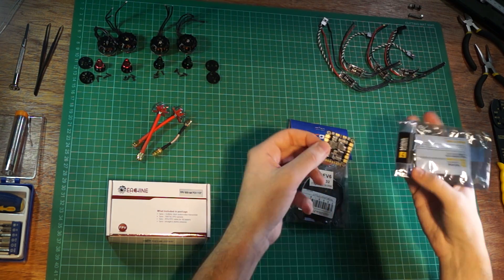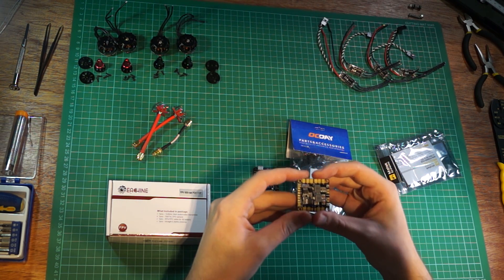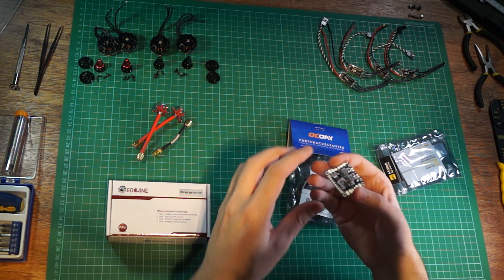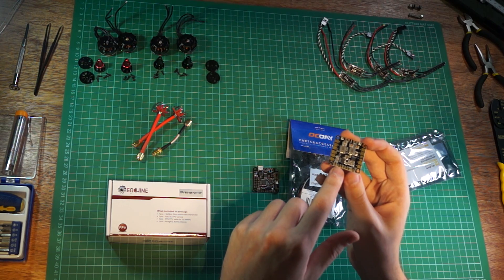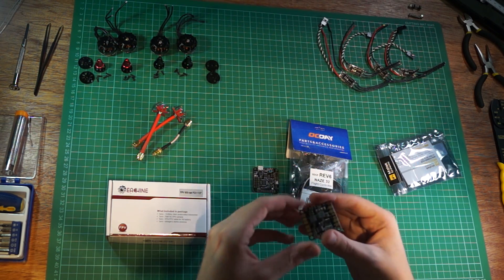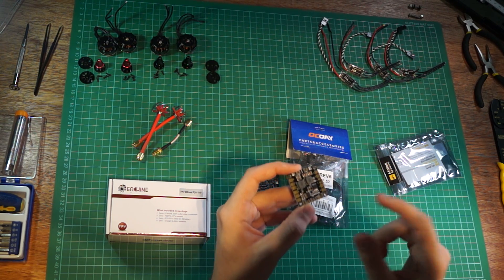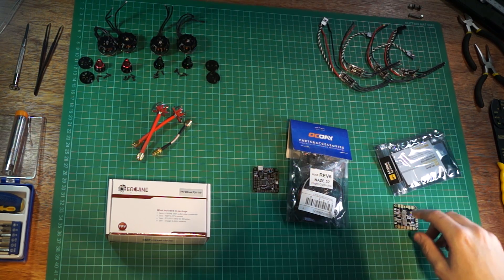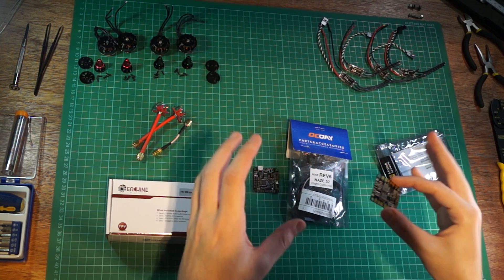This piece of kit is great — it's really small, fits in the quad on the standard mounting plate without any modifications. It's got the two BECs built in and all the contact points you'd ever need. It's got a video passthrough for the video transmitter and camera, but I'm not going to be using that. Instead I'm going to use the default wiring harness and wire it into the BEC on the power distribution board.